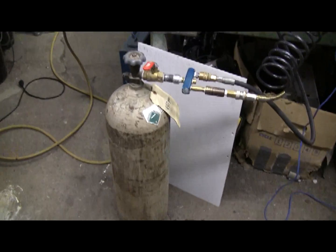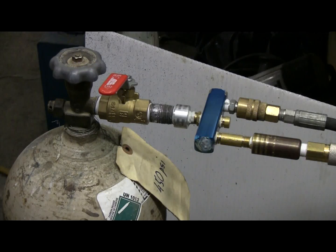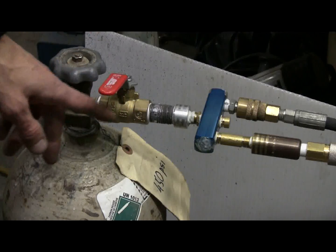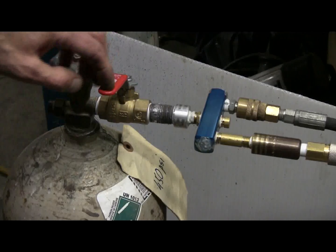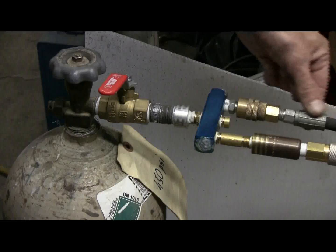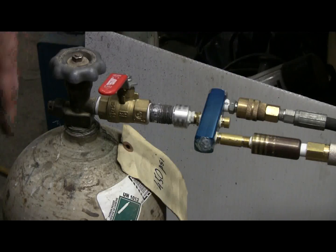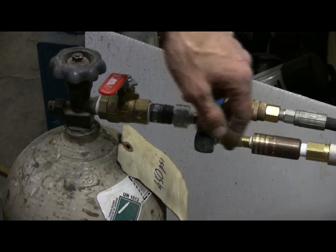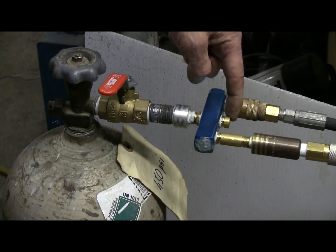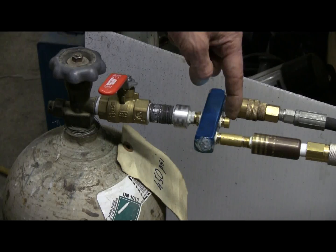Here's a look at the CO2 bottle and now we'll go over the manifold and connections. Normal CO2 tank valve. I then put a ball valve there because all the threads matched and it gives me an extra on/off. Then I have this manifold. Back here is the line out from the high pressure compressor so air can come in and pressurize the tank. Over here I have my output coupler and line which can lead to an air cannon. And this middle position I just have a plug, but eventually there's going to be a pressure gauge there when I come across one that I like.